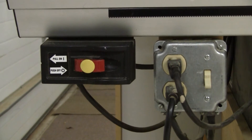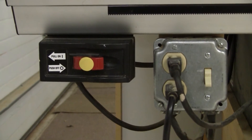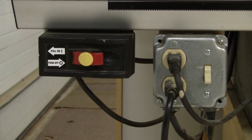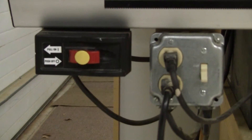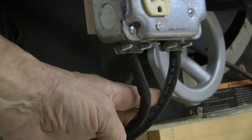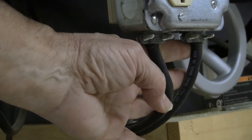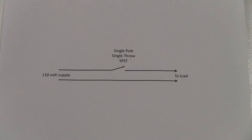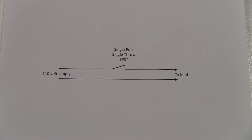Here's the box where those two cables wind up. It has a switch in it and it's got two plugins — one for the table saw and one for the vacuum. Here is where those two cables that came out of the outlets over there on that post actually go into the bottom of this box. What's inside that box is a double pole single throw switch, which can control two separate circuits because there's two separate cables going over there.